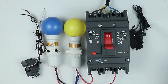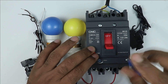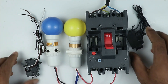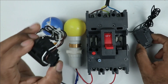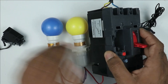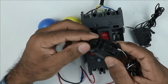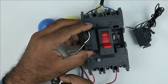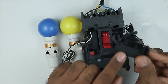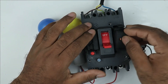For connection, simply open the cover of this MCCB breaker. I opened and removed the cover. Now here you can see some spaces provided — at these spaces you need to connect these contacts. The auxiliary contact has to be installed on the left hand side. Mounting of the auxiliary contact is simple — from this mount option, place it in this hole. This is perfectly mounted. The shunt coil also has to be mounted in a similar way, placing it in the corresponding hole.